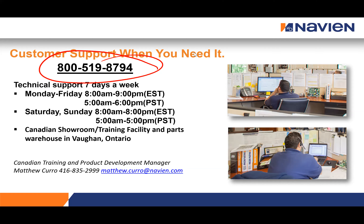Q&A: On using the unit with a storage tank for in-floor heating — I would suggest against that. A new requirement from the CSA 214 hydronic code states that when used as a combi, it can only be used for heating through an air handler. For in-floor heating applications, always use a combi-type system with a plated heat exchanger to keep domestic hot water safe and potable. One requirement in the new CSA 214 code is that water must fully circulate every 24 hours, with a minimum circulation time based on the amount of water within the system.